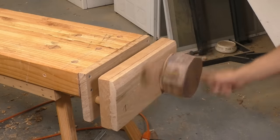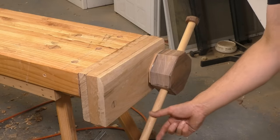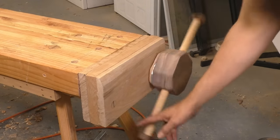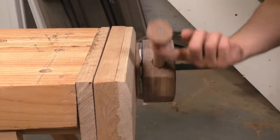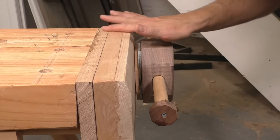Once your vise is well tuned, you should have gotten rid of that jitter and have a really smooth open-and-closing motion. Supporting the screw should also make the jaws line up vertically really nicely. But if your moving jaw still sticks up a tiny bit, just plane that thing smooth — don't worry about it. Once you've got your guide post well tuned, you might actually find that the right side of your vise closes just a little bit before the left side, and then the screw, when tightened, draws that thing in just perfectly. This is probably the optimal way the vise could perform, because that tiny bit of tension from the guide is going to make the vise hold very strongly.